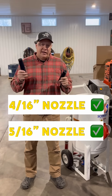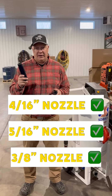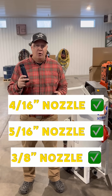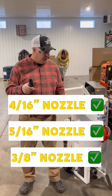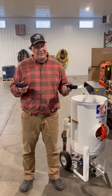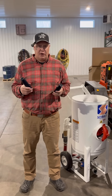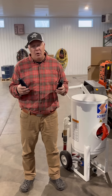When we got to the six, we saw our first pressure loss. It was three PSI difference between the inlet and the pusher line. That means the ferrule flow is getting maxed out at the volume that could flow through it — hence we would have more pressure in our pot than our line and we would sandblast our grit valve. Three PSI I can probably live with because of the 25% increased production and the better pattern created by the ferrule flow.